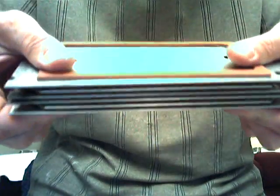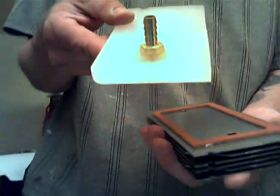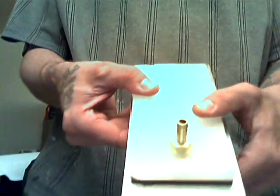I also left my edges long so they could double as cooling fins. I'm going to be using this chopping block piece as my top and C-clamps to hold it together. One of the ways I cut this stainless steel is with a pair of snips. The trick I came up with was to put the metal inside the snips, then put the snips in the vice and just crank the vice closed — and it just snaps right through. I wanted to share that because it was a pretty cool thing I found out. It saved me a lot of time and trouble.